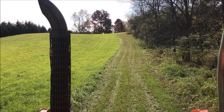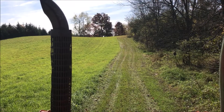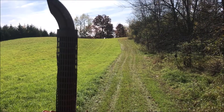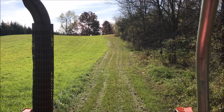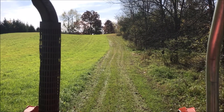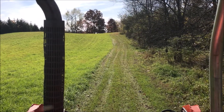When I was hauling that rock out, I had to go down this hill. Knowing that I was right at the tipping point, I backed down so the rock was always on the uphill side. Because if I had come down nose first with gravity, I think the bucket would have gone right into the ground with the rock, and then I would have had to stop, take the chains off, get the bucket out of the rock, move the tractor around to the downhill side, load it again and go. So my tip is: when you have a big load on the front or if you have a steep hill, go down backwards, moving up head forwards.